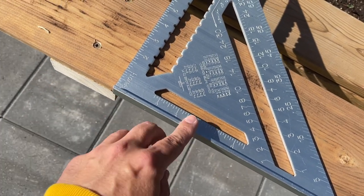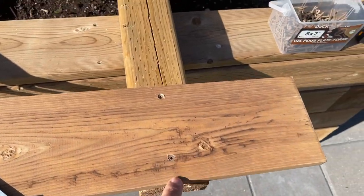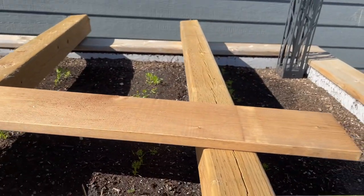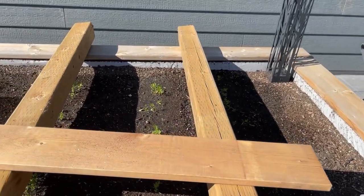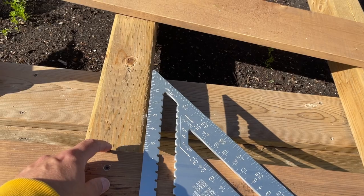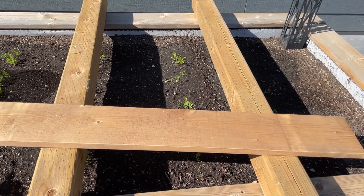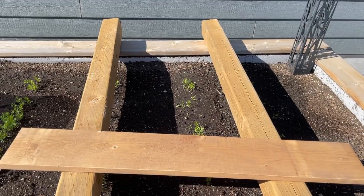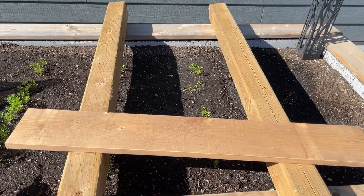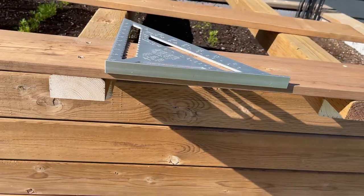I measured with the square to make sure it was lined up nicely, then did another check from corner to corner - everything's lined up and square as possible. There is just a wee bit of a twist in these four by fours; they've been sitting outside for a little while and that's what wood does. I'm going to give a little bit of space in between each board - I'll need to go get a spacer so I keep it equal each time. I'll put one at the far end and then measure the distance to give me my spacing. Here are the ends that sit on the six by six - looks really good, going to hunker in nice and be level.